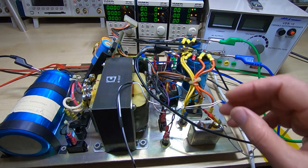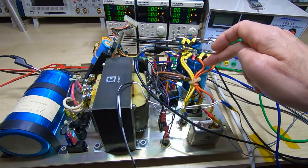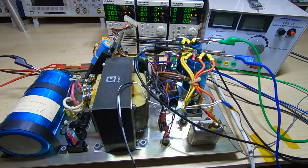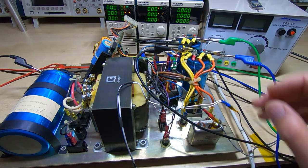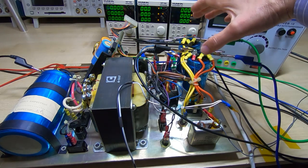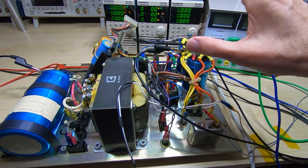Initially the relay was there to allow the voltage to come up before switching in the main supply, giving a more controlled startup. It also allows the key on the front of the unit to turn the main power supply off. You can't pass these rails through the on/off switch partly because it would require huge wires to the front panel, but also because it would destroy the switch after a few operations. I believe this supply can provide up to around 15 amps at 8 volts, and up to about 8 amps for the plus and minus supplies. These are just the raw, unregulated supplies.